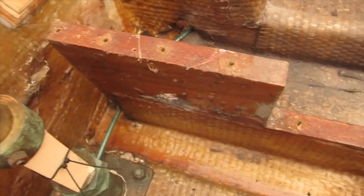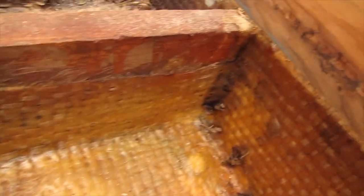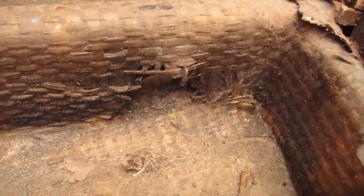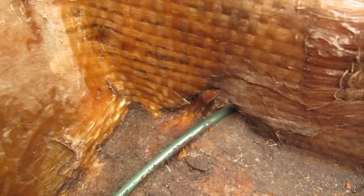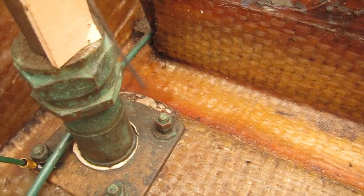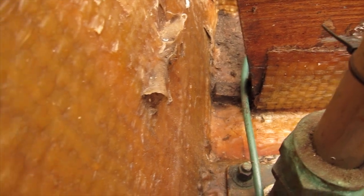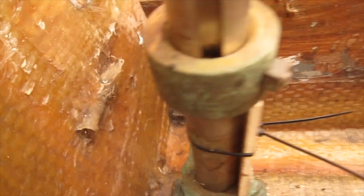Here's the entire length of the port side board I want to remove. The tabbing looks pretty good on this side and you can see how it goes all the way to that piece, and then it kind of stops short over here. Now the weird thing here is if you look at the stringer there's a limber hole there — it's not very pretty, I'll fix that up — and there's another one back here. But when they put this piece in there's no limber holes, so there's no way for the water to get out of here except going all the way to the back where that wire comes through. That's a ground wire for the fuel tank. But even the piece of wood back there is kind of cut off funny, so it's a little strange. Obviously it was put in later on after the fact.